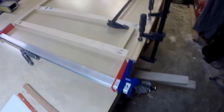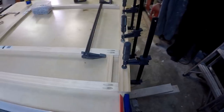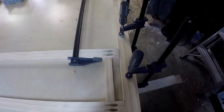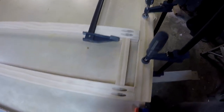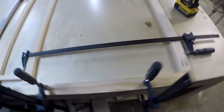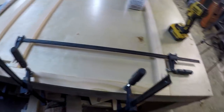This setup here is to glue and screw the other side — things are slightly warped, we're talking a heavy 32nd to a 16th at the most. So this is a spacer to keep these two apart, and this clamp is just barely screwed down to get everything to match up perfectly.